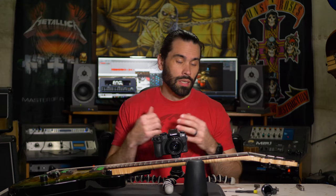That is where I want to be roughly. One thing to note is that if you need to make big changes — I turned it probably over half a turn, maybe three quarters — more than likely after the guitar settles, I'm going to have to adjust it again. Don't think of it as a set-it-and-forget-it thing; it will take a couple more tweaks after your guitar acclimates to the change. Now, since I let tension off the truss rod, I want to actually add some tension back in — similar to how you always tune up to pitch rather than down. I'm going to add a little more bow so I can demonstrate how to add tension and straighten it out.